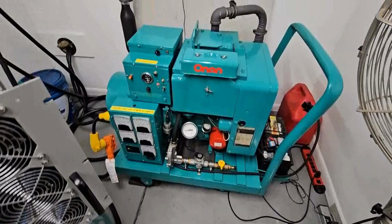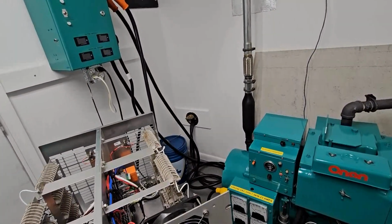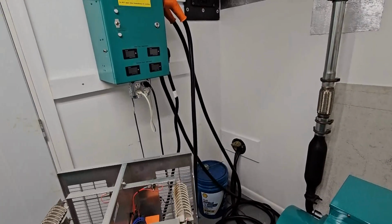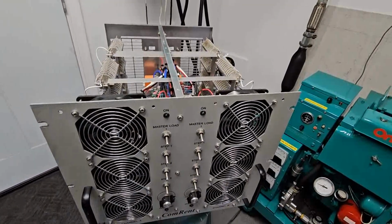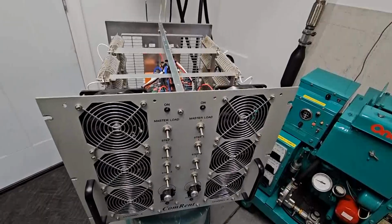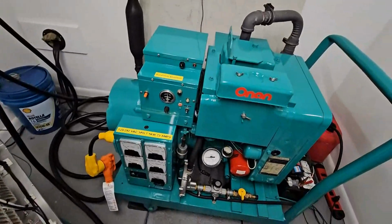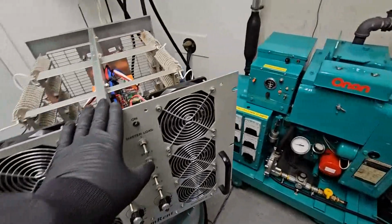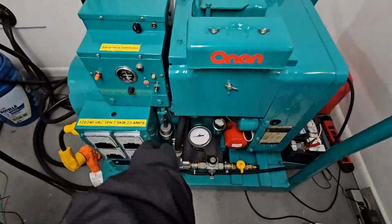By the way, I made a mistake in my calculations. We were drawing about 5.5 kilowatts on each leg, as you saw, and I said the total was about 10.5. We actually got very close to 11 kilowatts out of this load bank right here. It's rated for 10, so obviously it was conservatively rated. We're happy with that. All right, let's get back to the JB. Again, a 7.5 kilowatt unit. This should bring it down to its knees. Let's go and start her up.